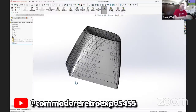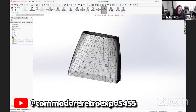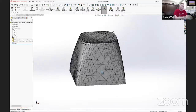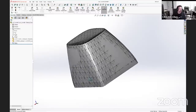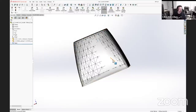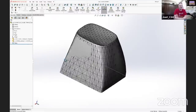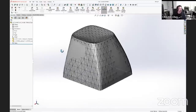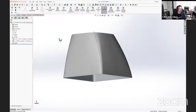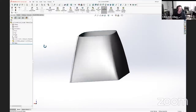So this is the actual 3D model that is actually correct. You'll see this is how much variation there is in the Commodore keycap itself. So if you build something that's fully symmetrical using an actual CAD program, you can see this section here is off. It's off — a result of either the mold or the design methodology used, the tooling wearing out, or whatever the cause. So if we hide this part, we end up with something fully symmetrical.